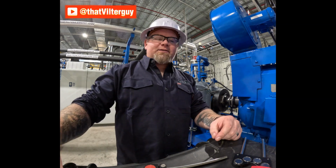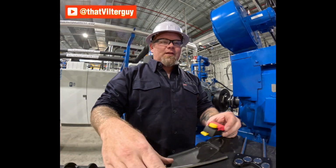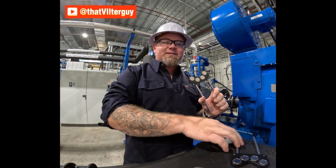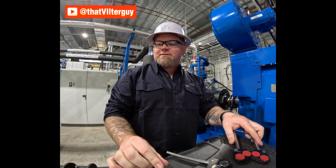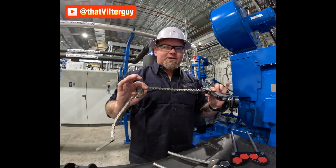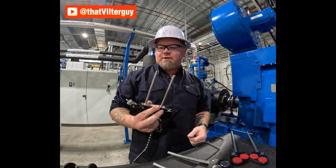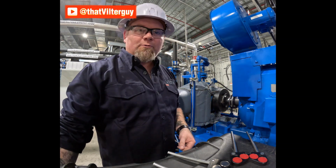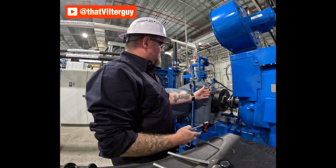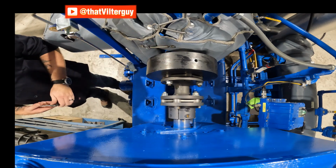So with the Pruftechnik, you get the reflector and the laser. But there are a couple ways of putting it on. I like these magnets. Magnet mounts are great, but they also have the chain mounts, so the chain lock, so you can go right to a shaft or coupling hub. These are a great tool as well, great device. I just really appreciate the simplicity of the magnet, especially with something like this, where we have this large inertia wheel mounted onto this compressor.